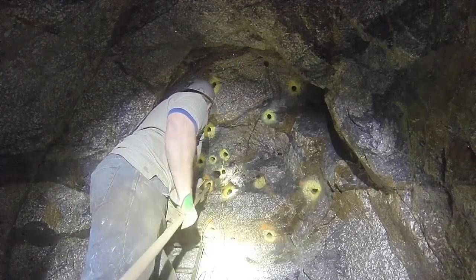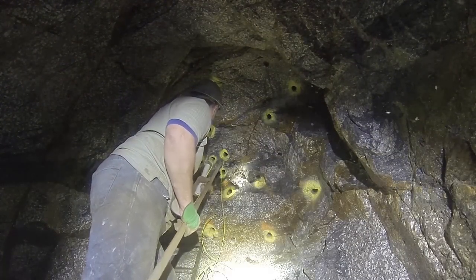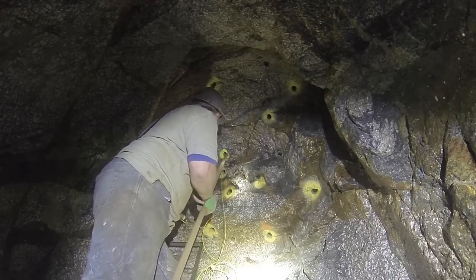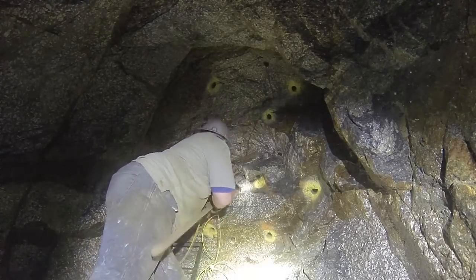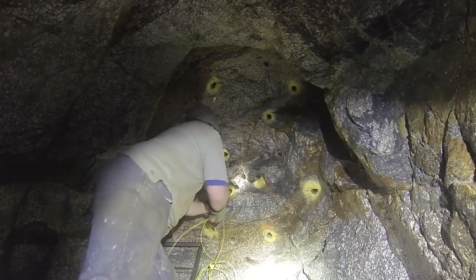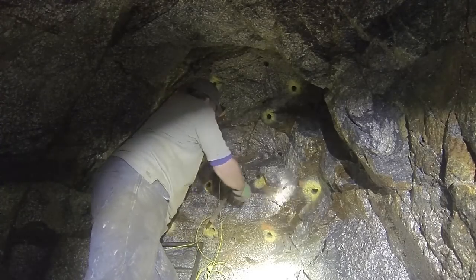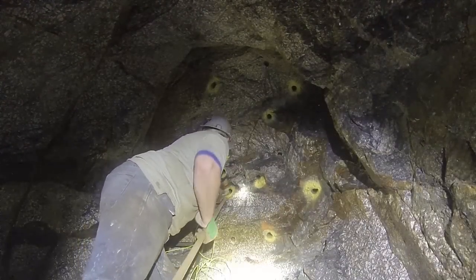And that one cuts a slot across there. These holes aren't blasted yet. This hole here will fracture into those two holes. Okay, you have like a little letterbox then, and then these holes here will be fired. That's a slot that will fire in, and then you actually have a square, which is the main shape of your raise.